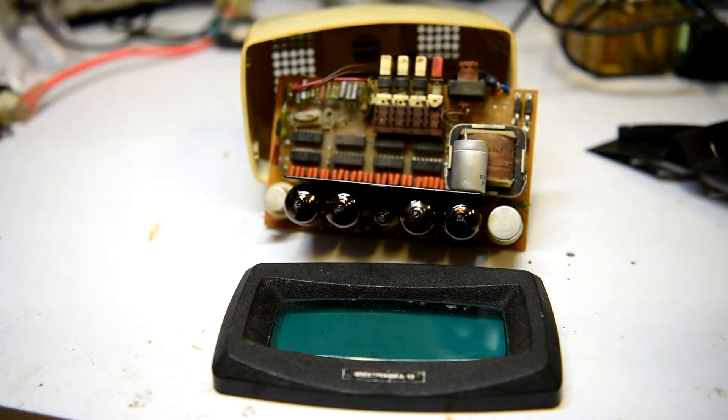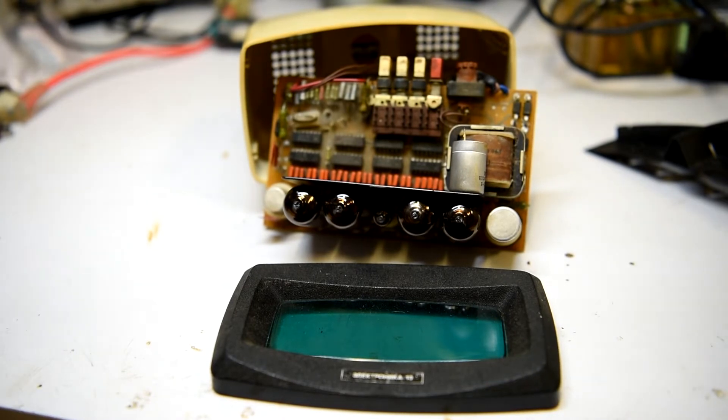These are your two main filter electrolytic capacitors. This is one I've taken out of a clock previously — one of the legs is completely corroded. So it's probably a good idea to replace the electrolytics in these things because they've been sitting around since the 1980s and are probably drying out and might not be much good anymore.